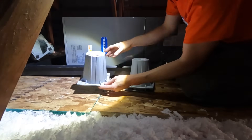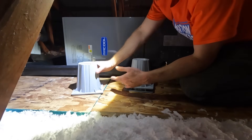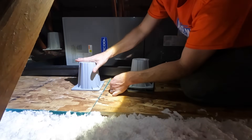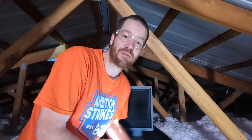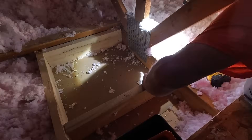These are little plastic riser deals that are meant to lift this unit up so that it clears the pan. It also gives us the slope we need for our drain line for the condensate, and it's got little stickers so these will adhesive into the drain pan and not slide around. With the air handler in place, it's time to move on to the intake venting, going right over here. That spot is in a central location that will allow air to be drawn from both ends of the house. The research I've done has indicated that restricted return air ducting is one of the most common mistakes in air conditioning leading to efficiency loss, so my hope is that by having a nice, short, big return air duct right here, we're going to have a lot of airflow through this unit and keep the unit as efficient as we can.